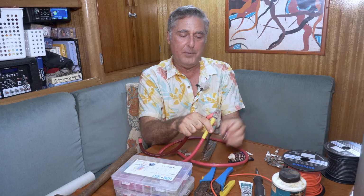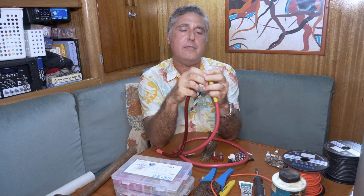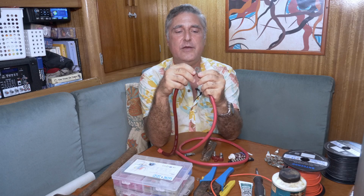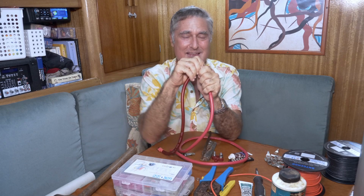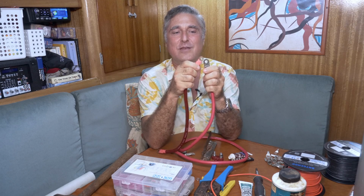You would want to put the bolt on good and tight so that it presses them together quite firmly. If you have a bad connection, you have room for oxygen to get in there, and also just plain when a contact has an elephant standing on it, it has better connection and lower resistance than when it's sort of in the area of the same place. That's not a good connection. That is a good connection.